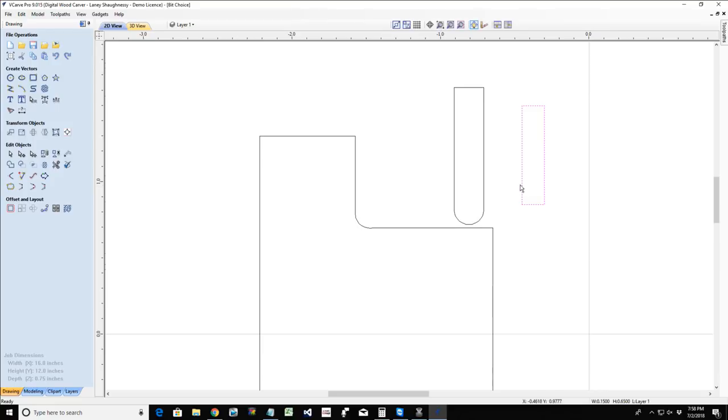But I've seen people use a ball nose bit to do the rough cut. That's fine. It's not like you're breaking a sacred rule. But generally, you're using a flat end mill, upcut, spiral, downcut, straight cut, doesn't matter. You're generally using a straight bit to do your rough cut. But some people say, oh, I have a half inch ball nose, but I don't have a half inch straight bit, so I want to do a real quick hog out with my half inch ball nose bit. That's fine. There's a reason for doing that: it's a larger diameter bit, so it's going to remove more material quicker. So they chose that bit. But the rule of thumb is you generally have a flat bit for your rough cut, ball nose bit for your finish cut.